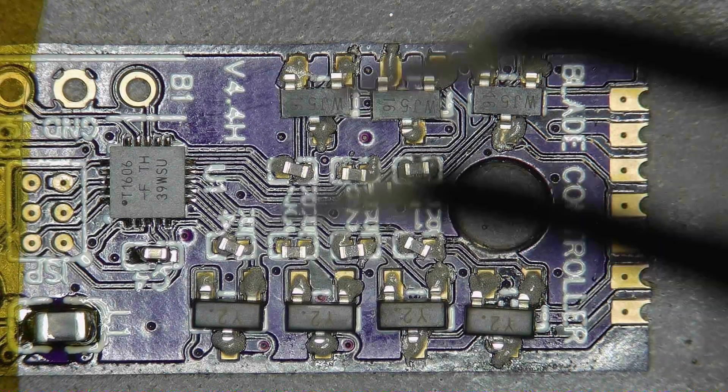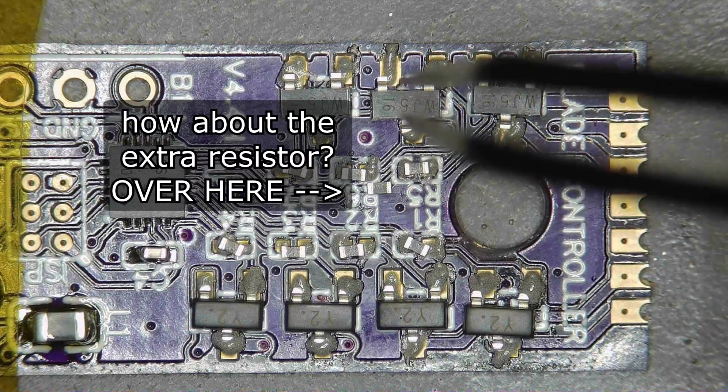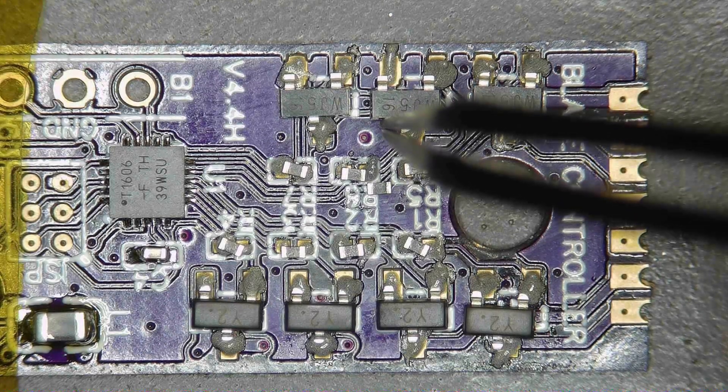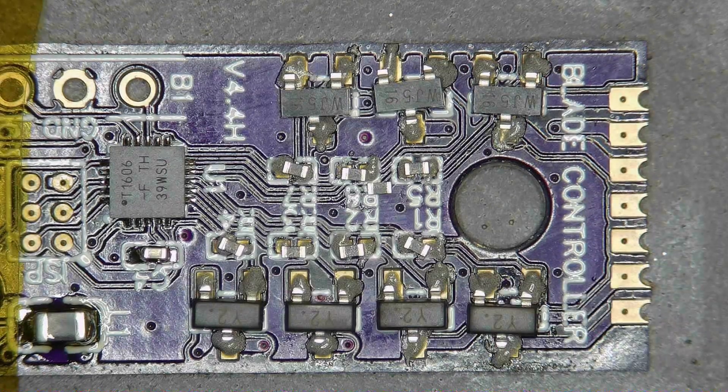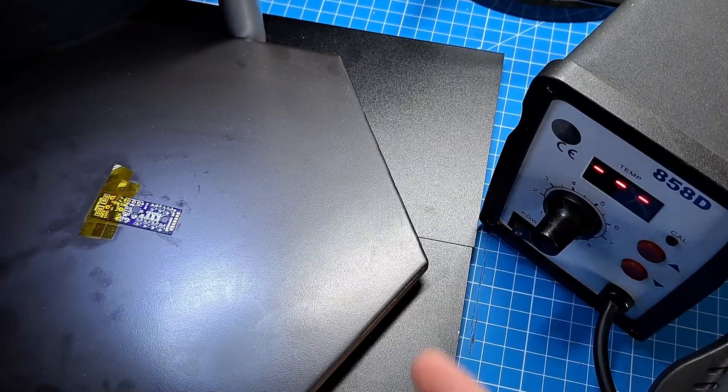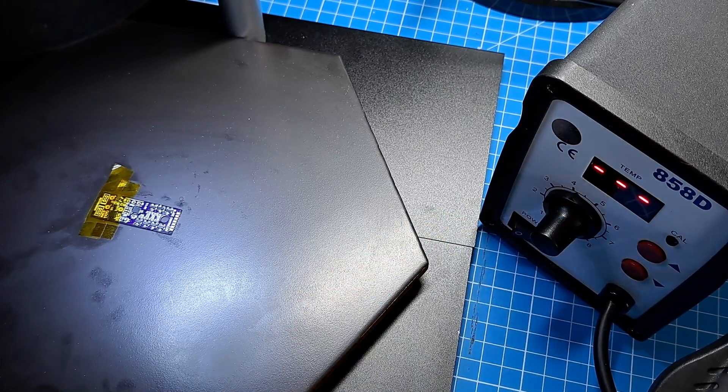Let's review and see if anything's a little bit in need of adjustment — maybe I'll nudge this one as well as this one. But I probably didn't have to, because the surface tension of the molten solder pulls the components to the pads for you. That's how you got the microcontroller to align and the voltage regulator to align — a few of those smaller components you saw were at an angle and then they suddenly straightened up; that's the surface tension. Components are down, more hot air, same process as before. Back to 4 on the nozzle and here we go.